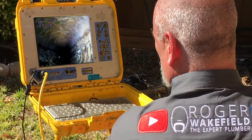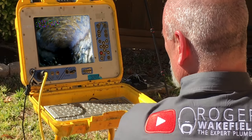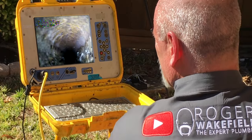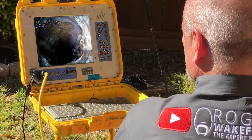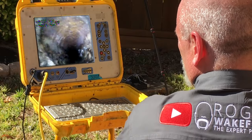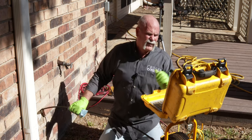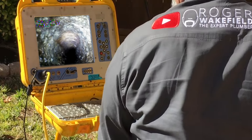Here's where I'm concerned about the bottom of the pipe — there's a big buildup on the right. That could be toilet paper buildup, or it could be that the bottom of the pipe has deteriorated, which is why you're starting to see that channel down in the bottom. Anytime you see those funny shapes on the inside of the pipe, that makes me think something's wrong. It could also be that toilet paper and different materials have stuck to the inside of the pipe along the years.